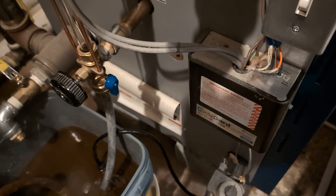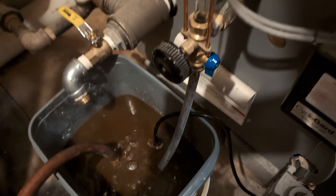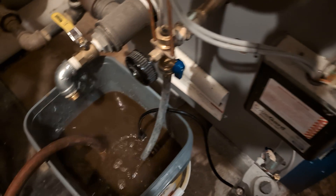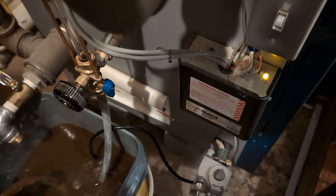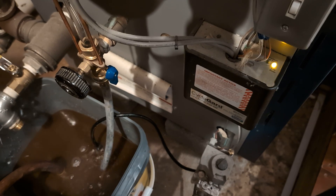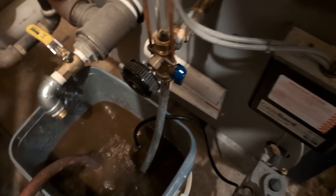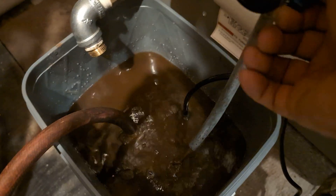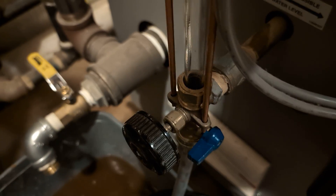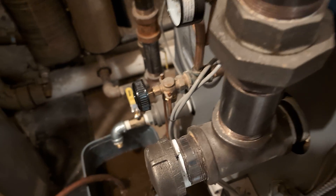This is putting the system under its most stress, as the boiler is firing. We're decanting off some dirty water, and in a few seconds that'll go solid. As long as it's 30 seconds solid, it'll shut the boiler off. I think the boiler has stopped running. We're going to stop the decanting process. You can see the water level is fairly low in the boiler.